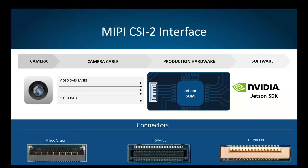Mechanical challenges can also be present, as each of these interfaces use different physical hardware connectors — there is no standard MIPI hardware connector, and each tends to be vendor-specific. The Jetson Nano and NX Dev Kits use the same 15-pin connector, and some camera manufacturers have designed their sensors with this in mind, though it limits the protocol to two-lane. Off-the-shelf hardware often involves an adapter board to connect sensor cables to production hardware, which becomes a challenge when moving to deployment.